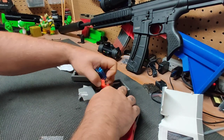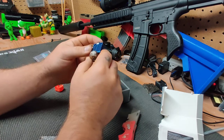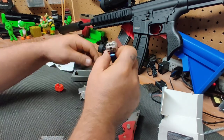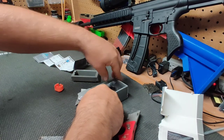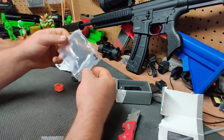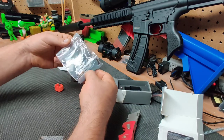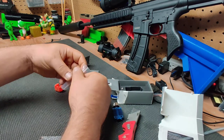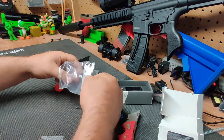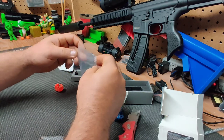I don't usually run too many abrasive materials, but I have been running the Gulf Coast for a while. I believe the max temp on that is 300, and even after a PID tune I have problems with it going higher than 260, so I figured I'd try one of these out.